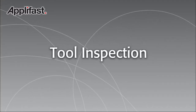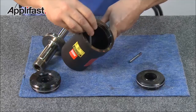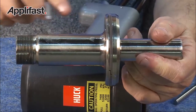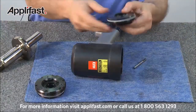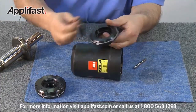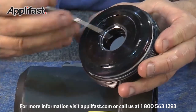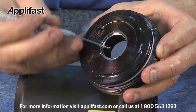To inspect the disassembled 3585 PT, first check the interior for scratches and score marks. Inspect the front and rear sections of the cylinder for scratches. Inspect the piston, looking for score marks on the front or back. Inspect the front gland — take it apart and add new seals to the inner and outer sections. Replace the seals on the back cap, both the inner ring and outer ring. The inner seal is held in place by a small lock ring, which is removed prior to replacing the seals.